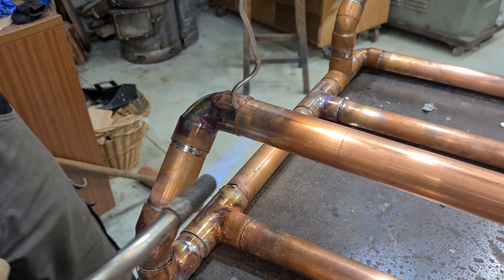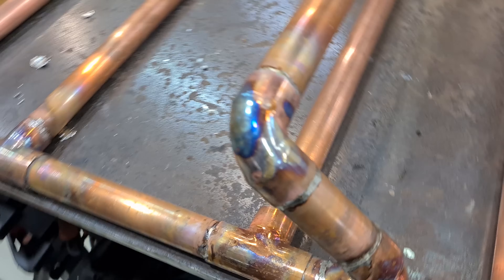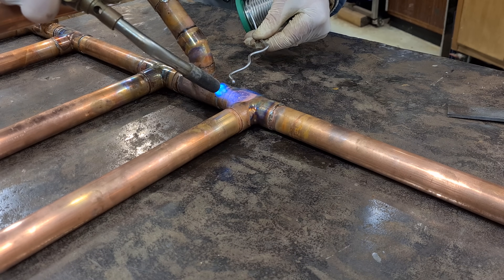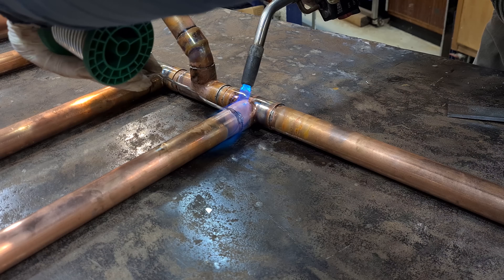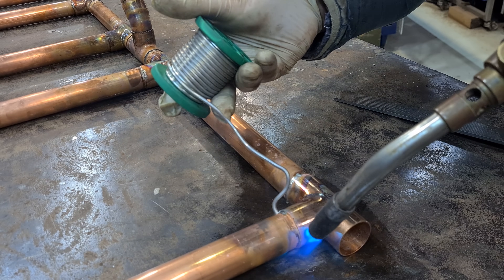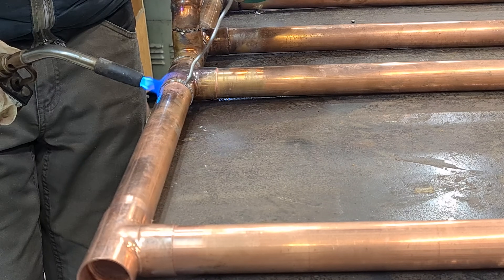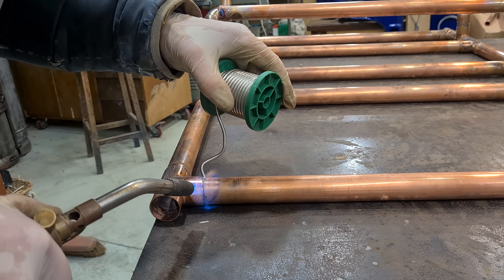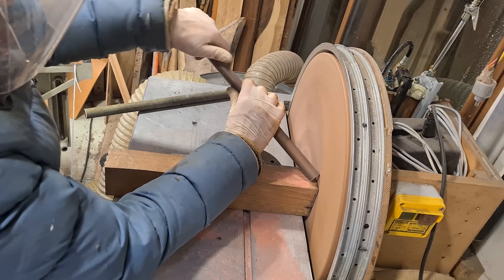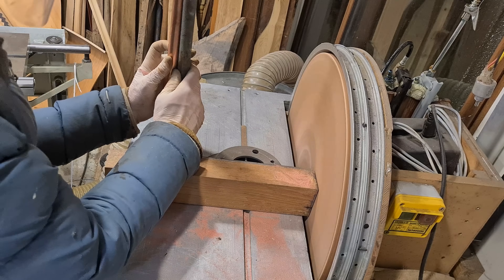After a bit of experience I started prepping and fluxing much bigger assemblies. They take a bit of thought as to how you sequence them and manage the heat flow throughout the assembly. If you get it right it's pretty cool because you're preheating the joint you're about to move on to as you're making a joint. Mercifully most of the joints here are on the flat horizontal plane, but for the vertical ones as a general rule you want to start at the bottom and work your way up, using the heat of the torch to try and draw the solder upwards. That'll counteract the tendency of gravity to make it run out of the joints.